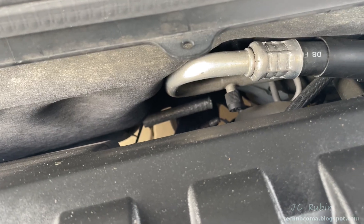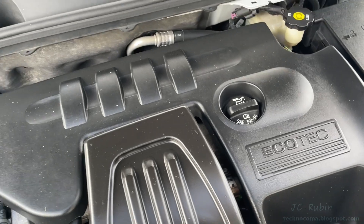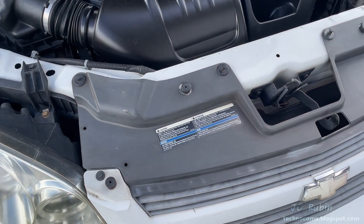GM fills the system with refrigerant and UV dye, and we have topped this off with gas and UV dye, but it hasn't blown cold for a while. So I don't know what the state is — how much gas is in there, or if there's any gas at all — and I need to see what we expect with a UV lamp.